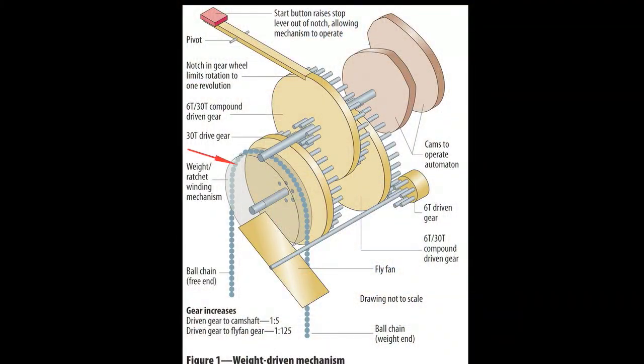The sprocket wheel, which is kind of grayed out in this picture, drives a pinwheel gear behind it. This in turn drives a second gear at a 1 to 5 ratio — that is, when the first gear rotates one time, the second gear will have rotated five times. The second gear is mounted on a shaft that replaces the crankshaft. You can see that the two cams are mounted on the same shaft.